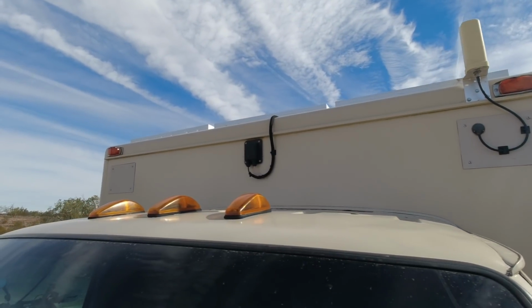I've got circuit breakers we're going to put in line. I've got wire loom that we're going to put over the cables. We're going to start on this today, and we should be able to get a pretty good jump on it. I looked it all over. There's already an access hole in the tall cabinet, and then I'm going to punch that through the roof. It came with a gland for the wires to go inside. Like I have one on the front of my rig, that black plastic, they call it a gland, and that's where your wires go up and into your truck, and it's weatherproof and gasketed and everything. So there's already a hole through that cabinet top, so I'm going to punch that on through the roof to bring the wires down. Putting the panels on the top, that's nothing.